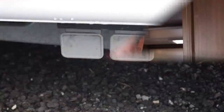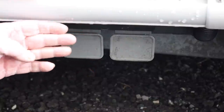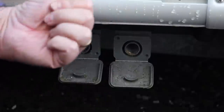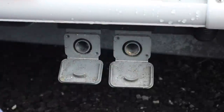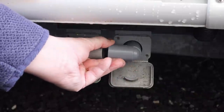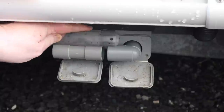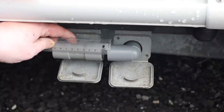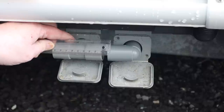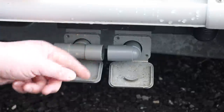Let's go outside with the ruler and measure up the final dimensions we need. Here we are outside the caravan - these are my two waste pipes, and you can see there's quite a distance where they go in underneath the caravan. I'm going to fit the angle piece at this end and the tee piece here, making sure they're lined up. Now what we need to do is measure this gap between these two points - that is near as damn it one centimeter, 10mm between those two points. Just measuring a bit higher up to confirm - yep, one centimeter between those two points.